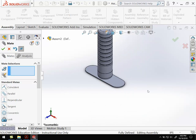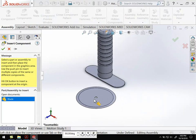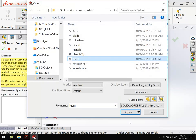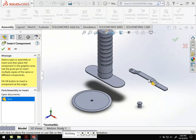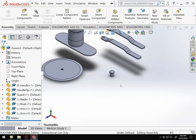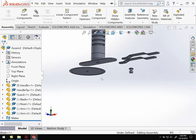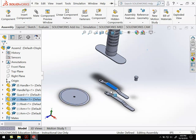I also need to add the bottom part of this pizza cutter. So I'll exit out of mate and go back to insert components. I'm going to insert the blade — this is the fixed blade I made 40 rather than 80 millimeters in radius. I'm going to insert the rivet. And I'm going to insert two arm pieces — insert one arm, and then insert a second arm. Now I've got to put together these pieces. The rivet goes through one arm, the blade, and then the other arm. I'll line the arm pieces up and the tops of the arms go into the hole in the guard. Let's pull all this stuff out of the way first.